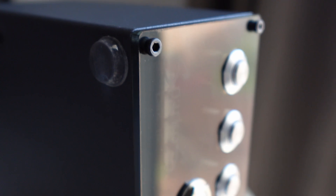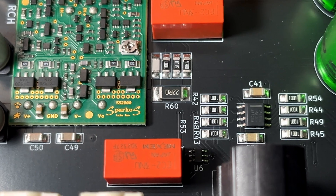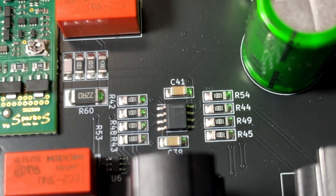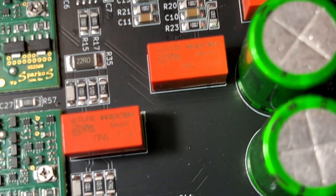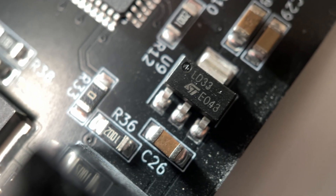How does a digital circuit exist inside equipment that is supposed to be all analog? This amplifier can be viewed as a smart amplifier because these buttons do not act directly on the analog circuit. The buttons are all connected to an Atmel microcontroller — a Microchip device, similar to Arduino microcontrollers — and when detecting a change in button states, the microcontroller acts on special relays for analog signals. This relay approach, rather than switches directly connected to the analog circuit, ensures more longevity and avoids constant maintenance. Even the power button triggers a relay, so there is always a delay between clicking the button and the change occurring — be patient. The digital circuit always consumes energy if the external power supply is connected.